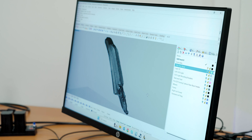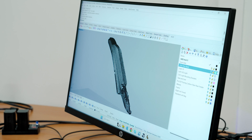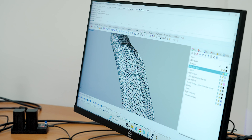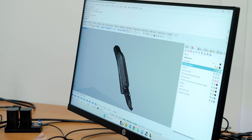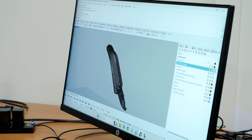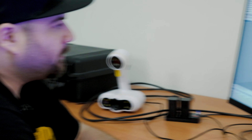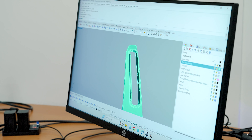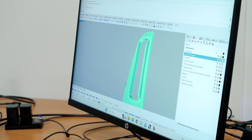So this is what it looks like in the CAD software. This obviously isn't something that we could send to a supplier and have made in the state that it's in — it's got a lot of jagged edges. So what you do from here is create some surfaces off of some points that you've taken, and once you clean it all up you end up with something that looks like this — an actual manufacturer-grade 3D model.